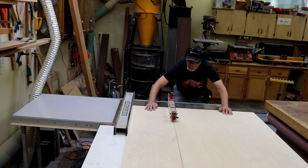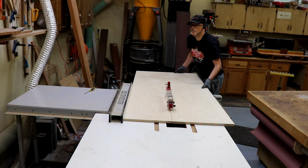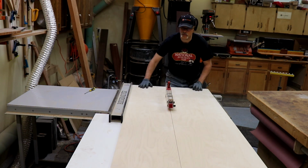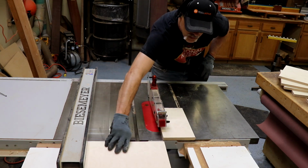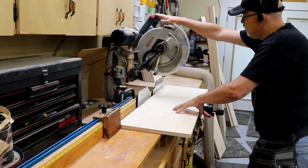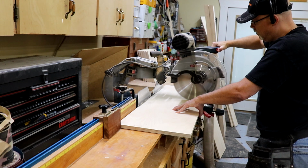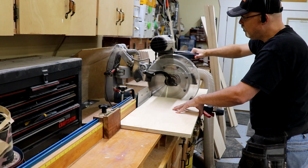For the first step, you'll just start cutting up your Baltic Birch or other high quality plywood. I used about 3.5 sheets of 4x8 plywood. Follow the instructions in the cut lists and diagrams at the end of this video to make sure that everything comes out just right for your full-size mattress. My design adds 1 inch in each direction for mattress size variation, but it'll be easy enough to modify for a queen or a king size mattress by just expanding the width of the center unit.